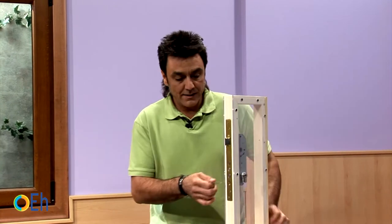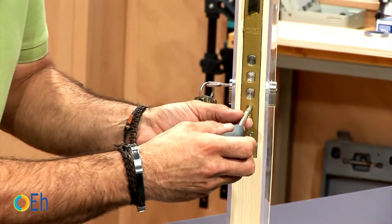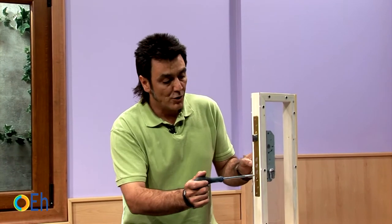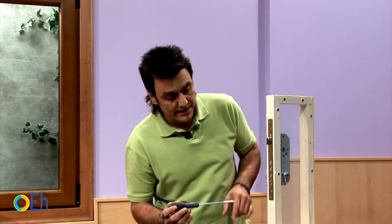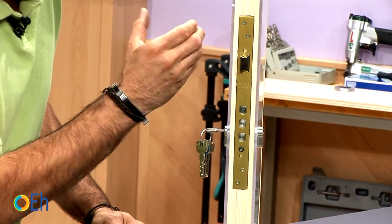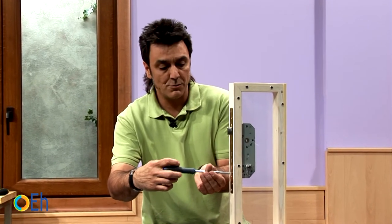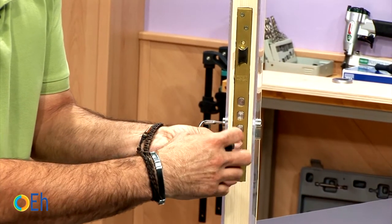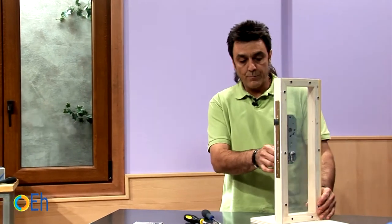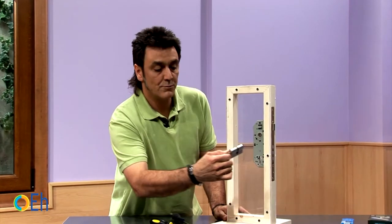Let's grab the opportunity to assemble another type of cylinder. We put on the wrench and loosen the screw. Sometimes the lock may be a little forced — to extract the cylinder you may also need to loosen the fixing screws of the lock itself a little bit, so that it has more clearance and facilitates removal of the cylinder. We removed this one. If we turn now, we can easily remove the cylinder.